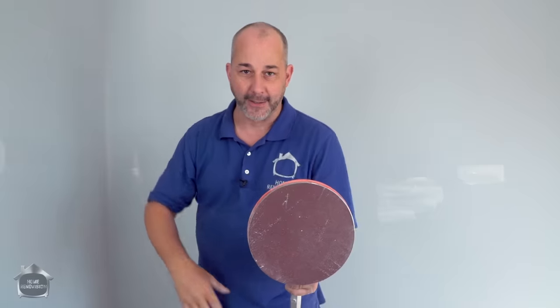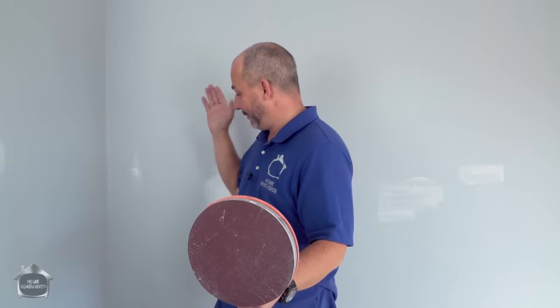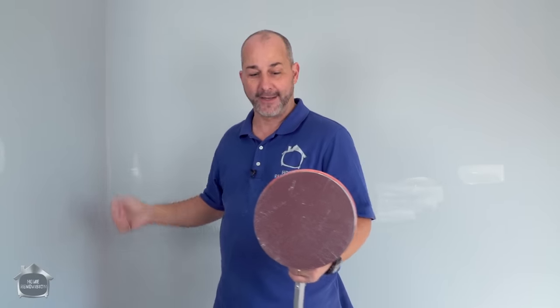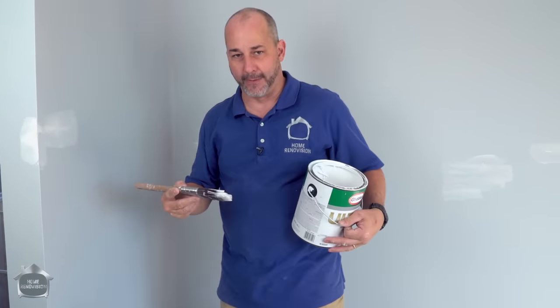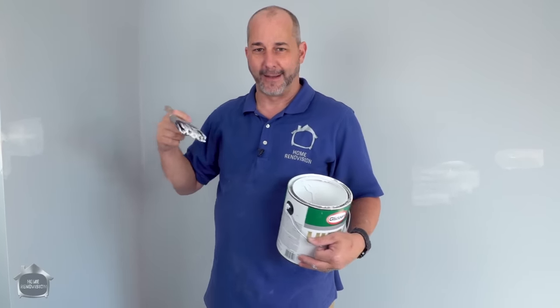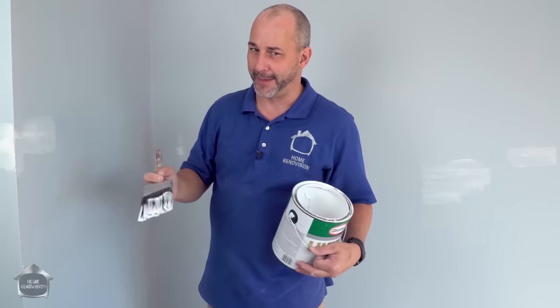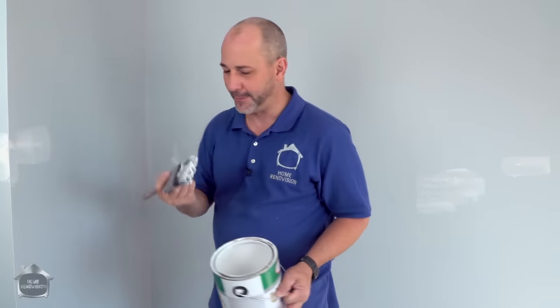So leave the dust on there, get your first coat, patch it, check it in the sunlight, repair it with your 45, sand it again, sand your whole wall, right? Then it's time to prime. Now, I've done this in other videos and I've talked about my sheetrock 45 material and how I'm confident that I can just go ahead and put two coats of paint on that and I'm good to go. But if you don't have that available in your area, then you follow this procedure.